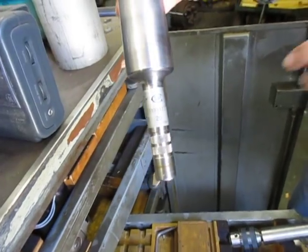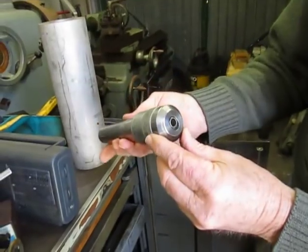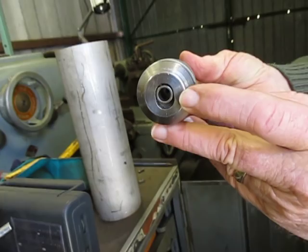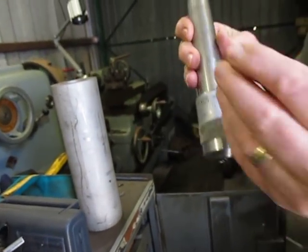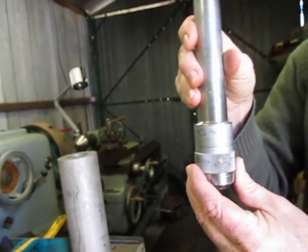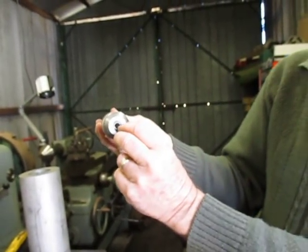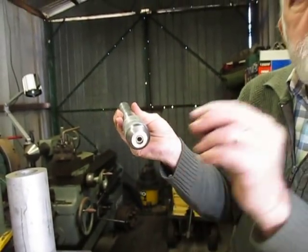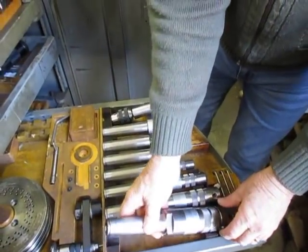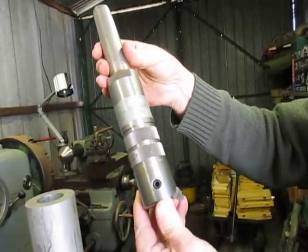Definitely by SIP — it's all original. This particular one is for doing offsets, so the tool fits in there for doing a very small amount in a hole. It doesn't actually wobble — it's eccentric, it's off centre, and it can just do a very fine cut. Right up to this one here, which is around about a two-inch maximum.